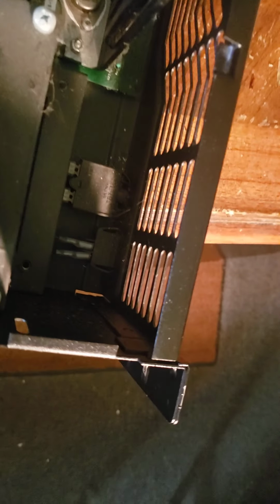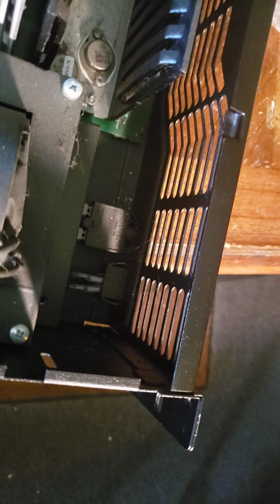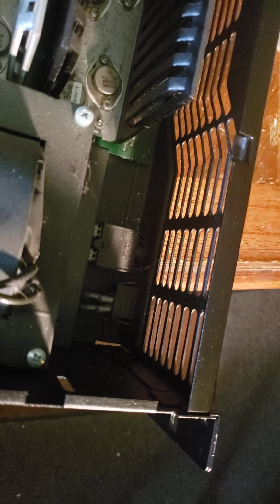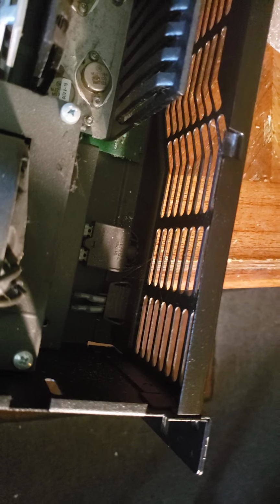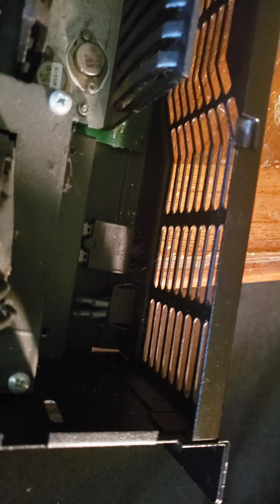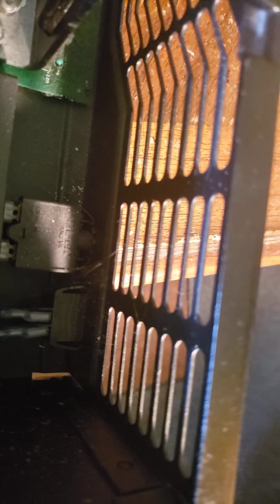And you're going to put the 2 leads coming out of the wall wart. I'm just going to go ahead and tuck the wall wart in here. I'm going to solder some leads, cut down the 2 prongs coming out for the 120. I'm going to cut them way down and solder 2 leads on them, and then insulate the top of them with some silicone and maybe wrap it in some plastic dielectric. Put some zip ties on it and then tuck it in here.